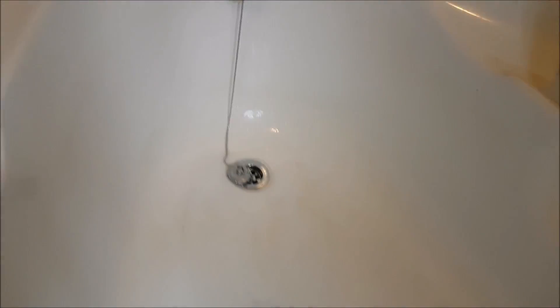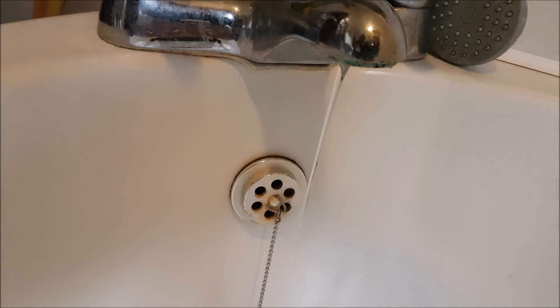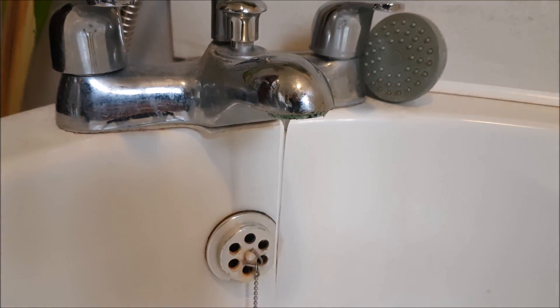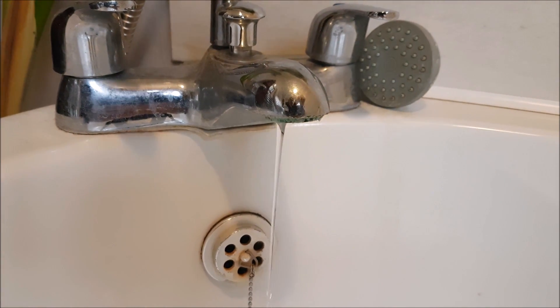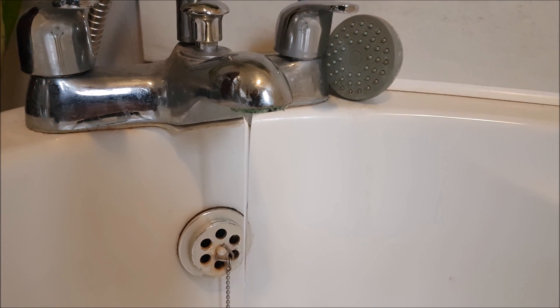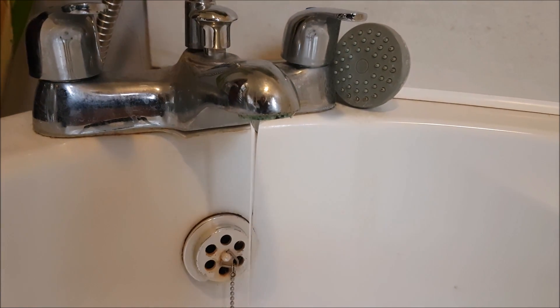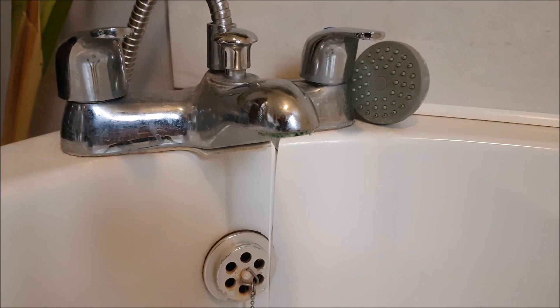I have a feeling the cold one could be causing the problems because the pressure in the house is very high. If you get a slight leak on taps with a rubber washer, what happens is a tiny bit of grit gets caught underneath the washer and then it's like jet propulsion — it works away and makes a very tiny hole in the rubber, and can also make a tiny hole in the copper seat that the rubber sits on.